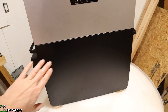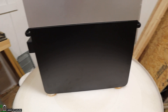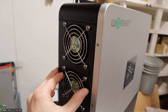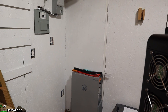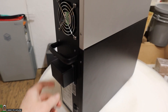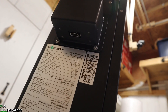Down here at the bottom is where we'll be accessing all of the connection spots for battery, communication cable, solar, and the output to power up this building. Moving over to this side, there are three cooling fans, and that should allow this inverter to stay nice and cool. I'm going to be installing this with somewhere around a foot of available airspace on the side, which will give it enough room. There is a handle on both sides where you can hold onto this and move it around. This black box down here is where you'll be attaching the Wi-Fi dongle — it looks like an HDMI port — and you'll attach that using screws included with the hardware package.